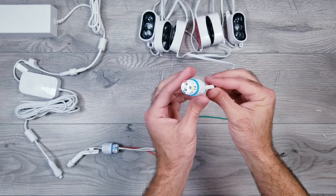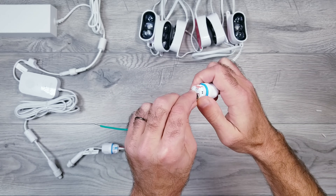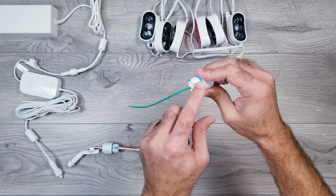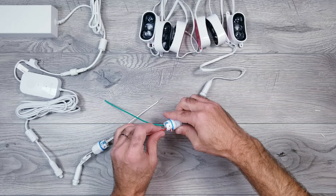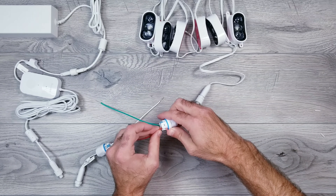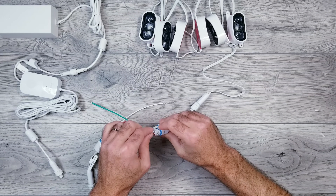Now, on the splice kit that's connected to our lights, I'll attach the green data wire to the yellow opening, which will eventually be feeding the WLED signal to the LEDs. From here, we want to connect the red voltage line coming from our first splice to this one going to the lights — this is what's going to provide the LEDs power. Then take one of our white ground lines and get that connected to the blue ground opening like I'm doing now.